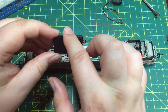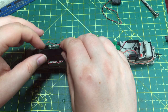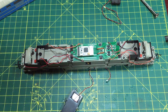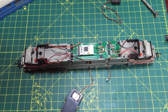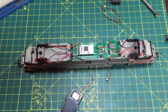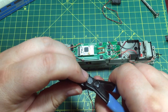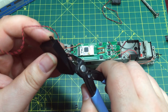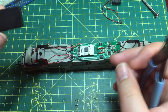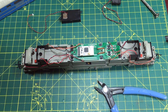And these screw holes, we can remove these if we need to. In fact, I'm just looking here and I have a feeling that it would just be prudent to nibble these off. They're not structural, and they're really just there for ease of users to secure the speaker enclosure. So it doesn't matter if you take these off. It's also not going to do any mischief to the sound produced. And I just use a pair of wire clippers here. And there you have it. I don't think we need to remove the end ones. They're not important in the slightest.